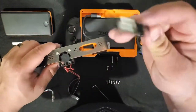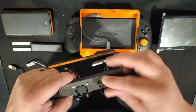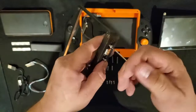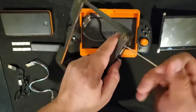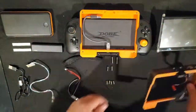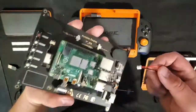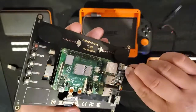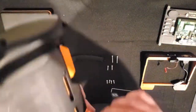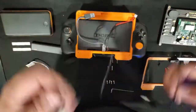After which we're going to mount the panel mount USB connector into the chassis using two 8-millimeter M3 bolts. Next we're going to route our power cables — the power cable for the touchscreen and the power cable that's going to run our Raspberry Pi — through the back of the controller through the small slots in the back.